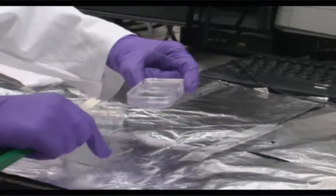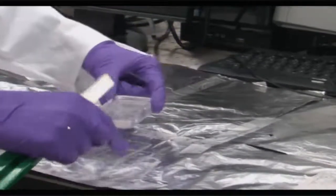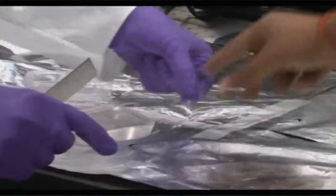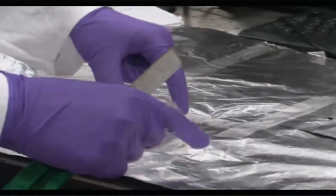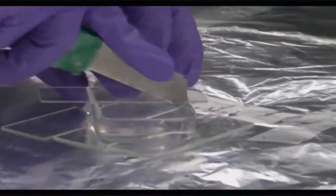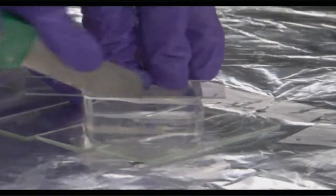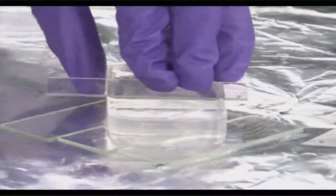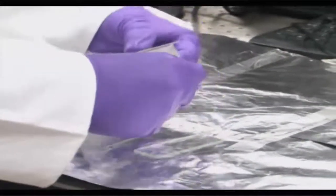You use a pre-cleaned glass slide as a jig to cut the PDMS straight. You can see that we are trying to lay out a hard surface over which we will put this PDMS mold, and then use a glass slide as a guiding jig for cutting off or scraping off the excess PDMS. So we make impressions, trimming off the edge and separating the material which is not useful from the mold material, which is somewhere inside. In a similar manner, you can do it on all the other edges, trimming them off.